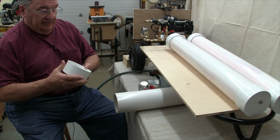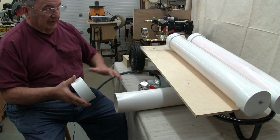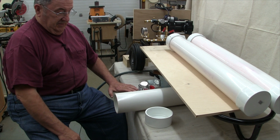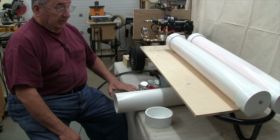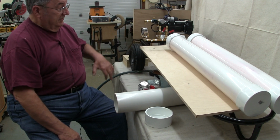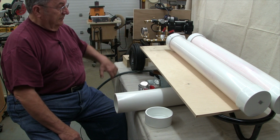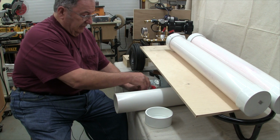And repeat the process for the end cap that doesn't have a hole in it. I'm going to put those up on the top side primarily to shorten the piping run that you see here, so that all the piping for the pump and the reservoirs is down there real close to each other.